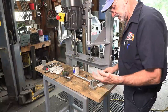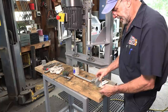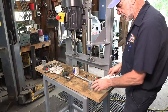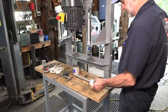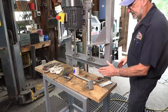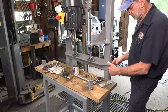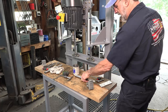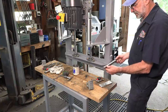Yesterday afternoon, late, I fabricated our stops. We got our material in yesterday, which was just flat bar and some 2x3-inch block, and I whittled these out really quick. The latest changeover on the backstop, that's what this is, and I've got the angle that goes across here over there, and once we mount these, we'll know center to center, then we can go ahead and drill the holes that mount it to the end of our rod. And this is basically an in and out adjustment.